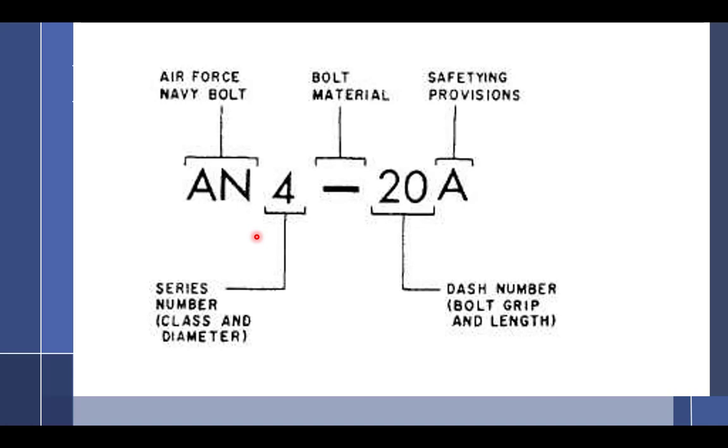Hey, Kevin? Yeah. For NF, National Fine Thread, isn't there also a unified standard thread? Not in aviation. Yeah, there really is, but I get more into that when we do regular hardware. There's really a lot more to it, but if you want to break it down to the most simplistic point, it's just those two, fine and coarse. So there's UNF, Unified National Fine, and it's the exact same thing except for one bolt, and I forget offhand which size it is, but it's one sort of far out there. Like a 12 or 14? Yeah, something like that. If NF is National Fine, what's NC? National Coarse.